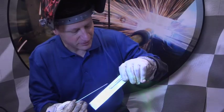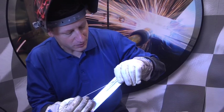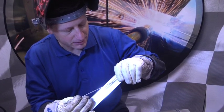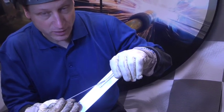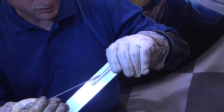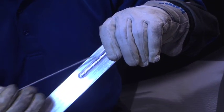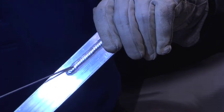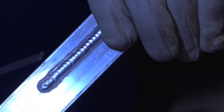Here we see we've made our first pass with adding the filler metal. We're maintaining a proper consistent width of the bead, so we've got our puddle control down pat. Our puddle deposition is pretty consistent — we were adding the filler metal consistently and our travel speed wasn't too excessive. There are a number of things that come into play when controlling the puddle on aluminum.